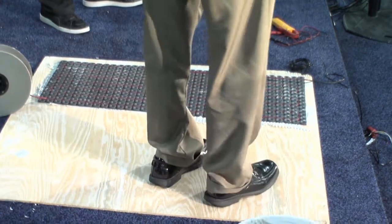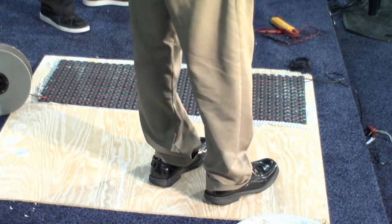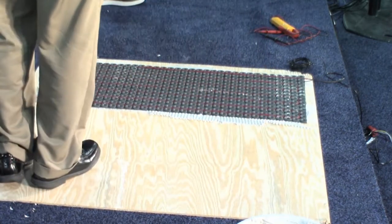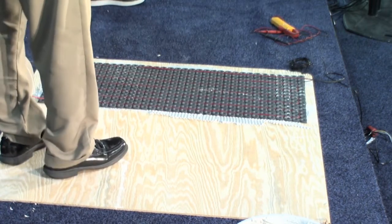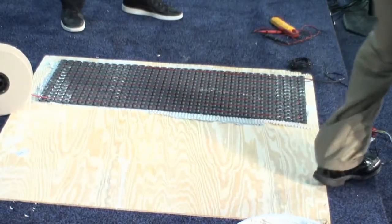So that heat sensor, you want to keep it away from any heat vents, the front of a vanity, just because people might put a rug down that might throw off the temperature of the floor. So you want to put it somewhere in the room where it's not going to be affected by possible other heat sources.